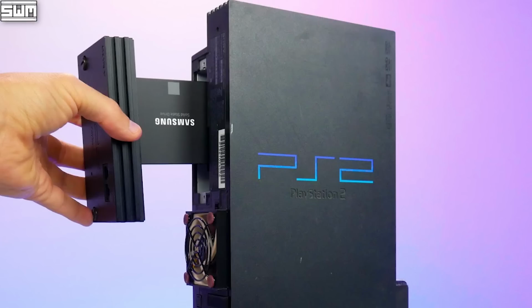First of all, if you missed it, again, I did multiple videos. One that detailed the process of installing a Samsung SSD. I also had to change out the IDE plug on that network adapter and make it compatible with SATA devices. And that's how I was able to get the Samsung SSD inside of the system.